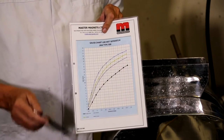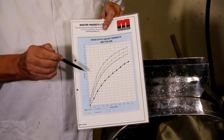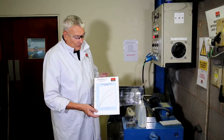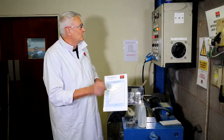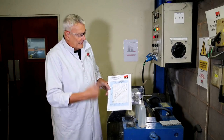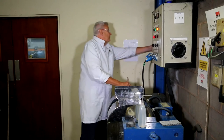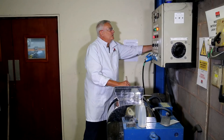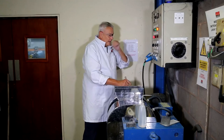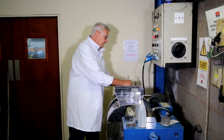When we put our different matrices in, that's concentrated up, and for the finest matrices we are getting up to about 2 tesla in the separating area of the machine. For this particular sample I don't need all that field strength. So if I set it to about 15 amps, I should have enough magnetic field strength and force to separate out and hold our hematite and allow the calcium carbonate to pass through. I now know that within the separating canister itself I am getting sufficient field strength to allow the capture of the iron hematite.